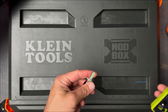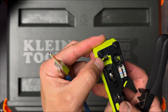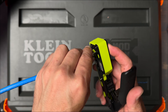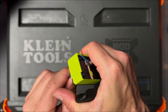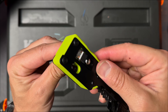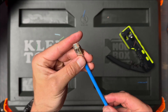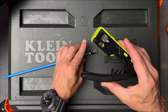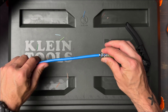Lastly, we want to crimp down. You can see it has this blade on it which will slice the end of these wires. Line it up, kind of bend them up a little bit so they don't hit the blade. Make sure it's nice and snug up there, then crimp it down — it should have a nice flush cut. And that's it. It's quite the task to do these RJ45 shielded ends, but if you have a nice tool like this with everything built into it, it makes life a lot easier. That's how you do it — thanks for watching.